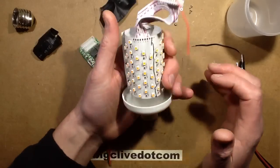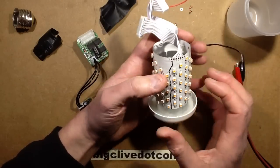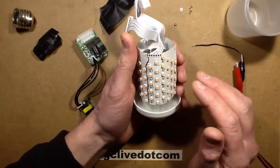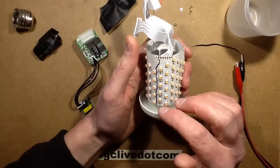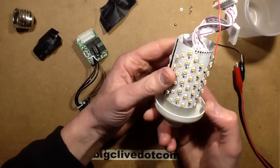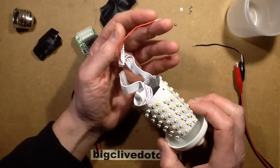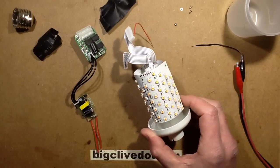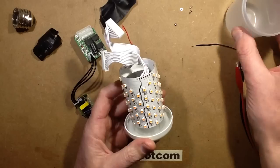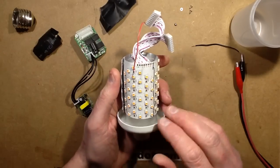It's a fairly typical design — although I can't really say typical, because this is the first of this type of lamp I've come across. I think it's going to be the first of a range of these lamps, and it's very impressive. I could almost see in the future the circuitry actually ending up on the panel itself. I'm kind of glad that the ULN2803s are being used, because I initially thought it was multiplexed and that was going to make it flickery. But it doesn't strobe-flicker — it looks flickery in the sense of looking like a flame, which is good. So in a sense it's a lot simpler than I was expecting, but that makes it very functional. The pattern does repeat roughly every four seconds.